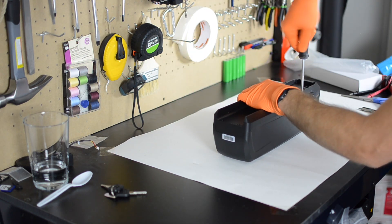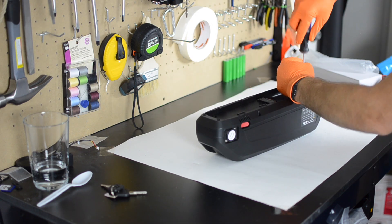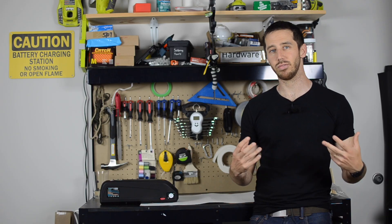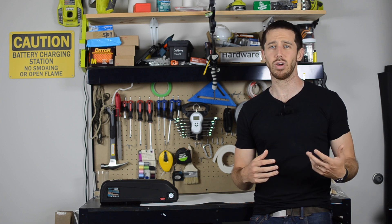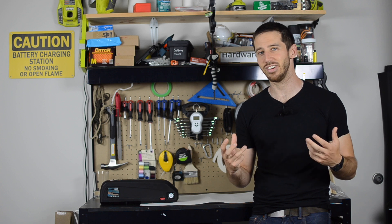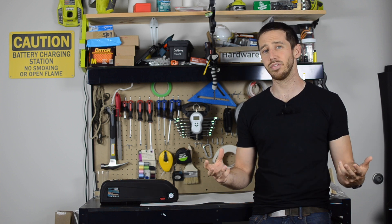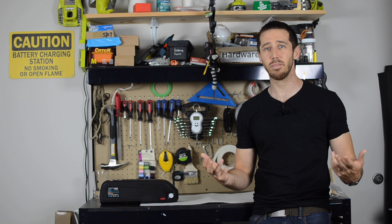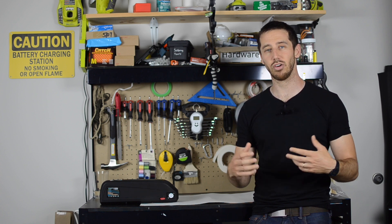But there are a few downsides. The nickel strip is actually nickel-plated steel, which is going to be an issue in terms of the power the battery can output without heating up and wasting energy as heat. The cells are not the best quality cells — I would have preferred to see cells from the big five, though these are probably alright for lower power situations. The battery is just sort of medium quality, medium power level. I would not want to run this thing at 30 amps, so I think to call it a 30 amp battery is a little bit disingenuous. That said, I would use this battery for a non-critical application and for a low power e-bike — like a 250 or 350 watt setup. I'm not going to call it a fire hazard because the construction actually does look pretty professional inside — it's just that there were a number of corners cut in terms of quality.